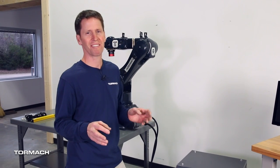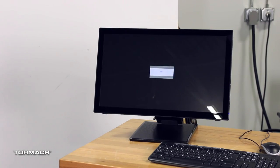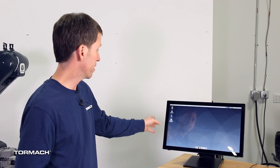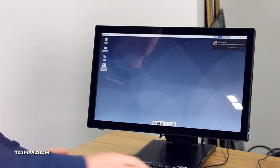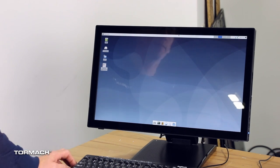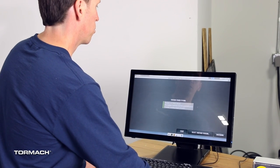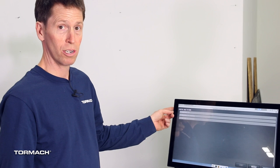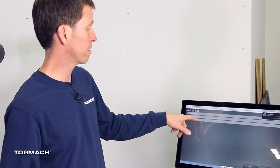If we've connected everything correctly, turning the rotary disconnect on in our electrical cabinet should apply power to the cabinet and turn on the control computer. When the system first powers on you're going to see the desktop and a PathPilot Robot Edition icon. Double-click that and it'll bring up the software. It'll automatically check to see if there's an update available and ask you if you want to download it. You should be shown at least one non-simulation configuration. If your EtherCAT connection isn't complete, you will only see the ZA6 simulation configuration.